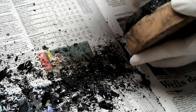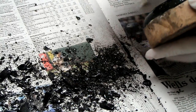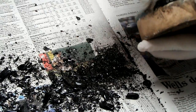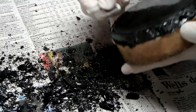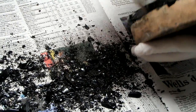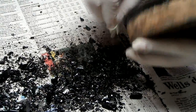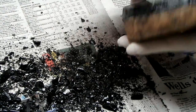These particular polishers were all made with number 64 pitch and they have just a slight bit of 55 in them to soften them up just slightly. I mold these onto the face of the mirror so that the curve is right to begin with, so it's just a matter of faceting with a razor blade and a slight cold press, and they're pretty much ready to go.